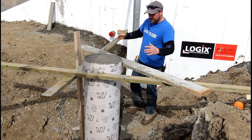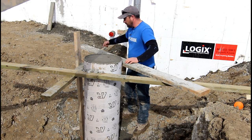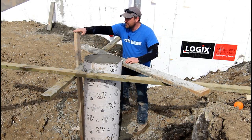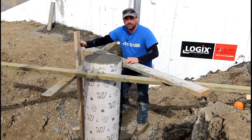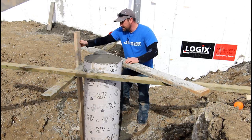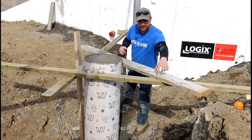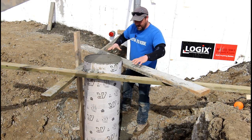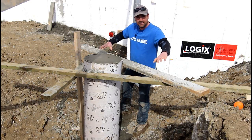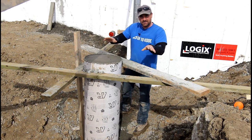Really all this is is a sandwich — there's no screwing or messing around. This board is back to the wall, it goes here. This one here sits onto the pile cap, or your footing pad, whatever you want to call it, so it holds it all up. This one braces it the other way, then we have a 45 that sandwiches it but also keeps the diagonal, so it gives it lateral strength so it's not just swaying.